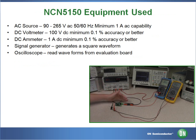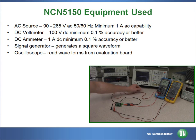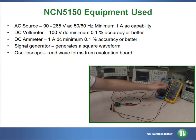The negative will be connected to the board. The positive will be in series to achieve the 42 volts. This will be connected in series to our ammeter to measure our input current and then to the board. We will also need a voltmeter to measure our output voltage.